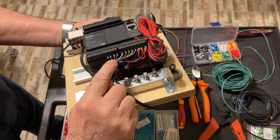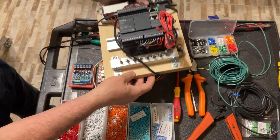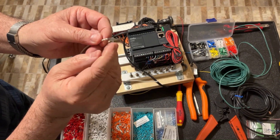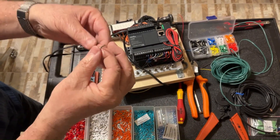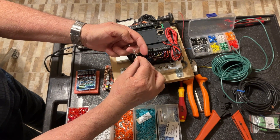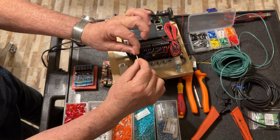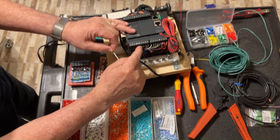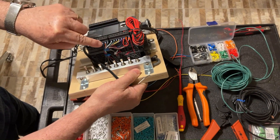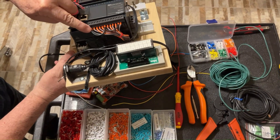Here at the end of these very tiny wires, these bluish things are ferrules. What happens is, anytime you use stranded wire, what may happen is whiskers — you don't want to plug these wires into contacts and have some whiskers remaining and touching other wires, establishing unwanted contacts. You want everything to stay in one place, and as you can see, there is no way any of the metallic cylinders can be seen — you only see the plastic insulation for the very tiny wires, and the same thing applies for thicker wiring on the other side.